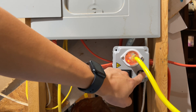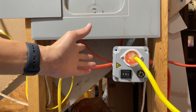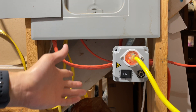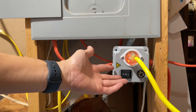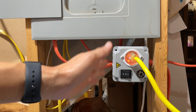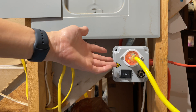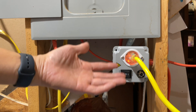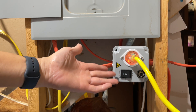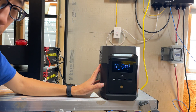The interesting thing about this unit is it has a 15 amp breaker, even though the circuit it's wired to is a 20 amp breaker using 12 gauge wire. On a 12k mini split it's not really a problem, because it doesn't draw that much power. But you probably won't be able to do this if you're connecting something high-power like an electric heater or hair dryer — it may or may not work depending on your situation.